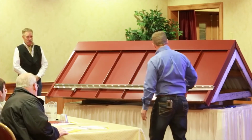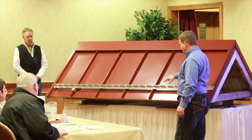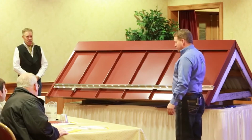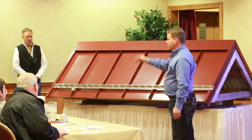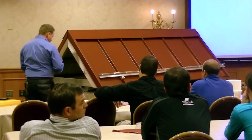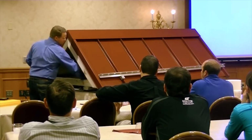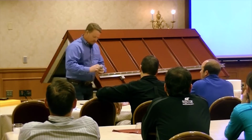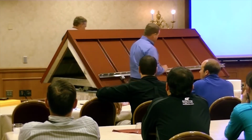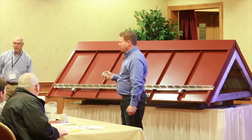The reason you measure up from one end and then the other instead of each panel is a metal roof is always going to be doing this. And that gives you a nice straight edge. What I'm installing is our ColorGard product, and we're going to use a VersaClip. The clamp I'm using is what we call the S5S, and this is for a snap seam profile.